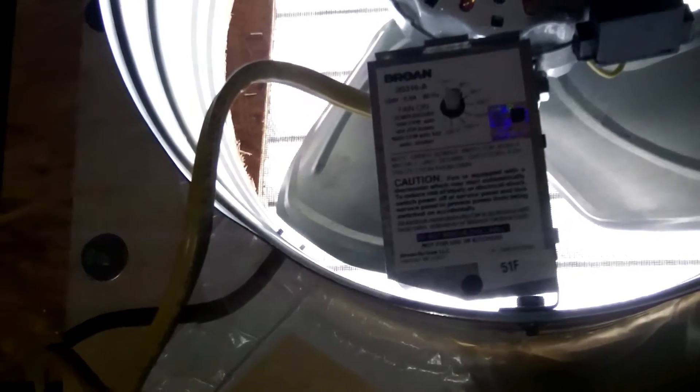I've got the wire snaked up to the fan and already installed the wiring to the fan motor as per the manufacturer's instructions for using the bypass switch option. I got it underneath some of these boards — it goes down here, you can see that — then I drilled a hole down through one of the base plates and snaked it up, drilled another hole through there, and wired up to the motor. The manufacturer's instructions made it pretty easy to get the bypass switch installed with the thermostat controlling it. I'm now stuffing all the switches back in the box. Spoiler alert — I already tested it and everything works, thankfully. That's why I'm putting the switches back in the box.